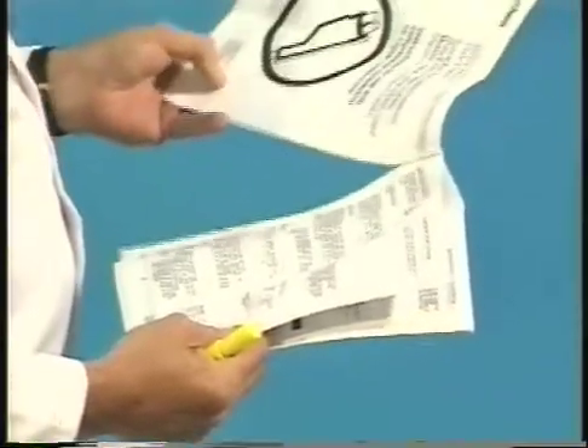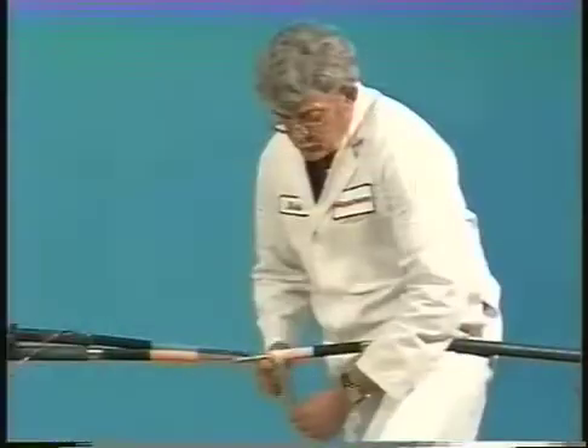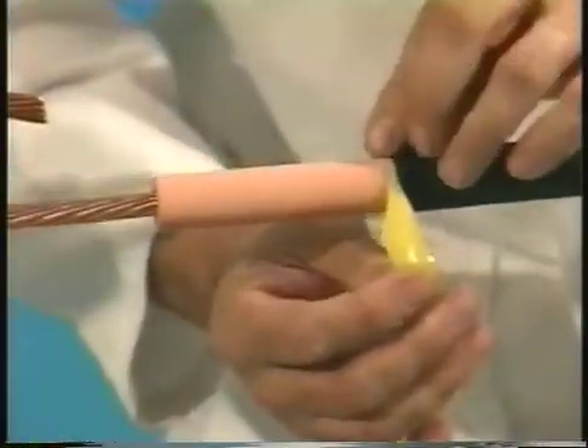To begin the installation, verify your kit selection and prepare the cables as outlined in the written instructions supplied in the kit. Here we've prepped metallic tape shield and wire shield, and we'll first abrade and clean the cables. After prepping the cable, you'll need to start by applying SRM at the semi-con cutbacks of all three cables, tapering it down to meet the insulation.